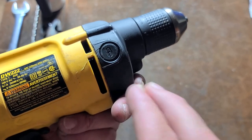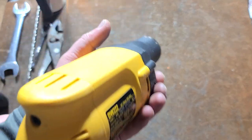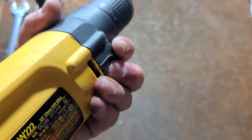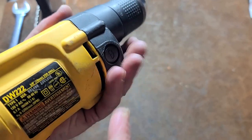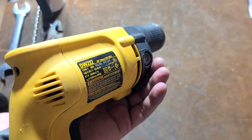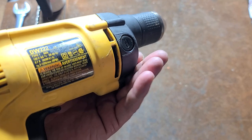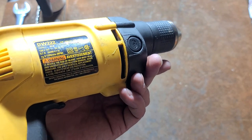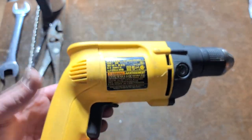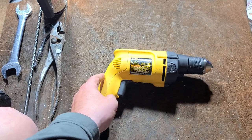This is a lock — just like on angle grinders it locks into the gear, but in this case it's actually a tooth that jams into the motor arbor itself. So if you're running this drill and you kind of forget, or you're doing heavy-duty work and you press that in, it's going to end up grinding the spindle on the motor — the most expensive part in the gearbox you could damage. DeWalt just stopped doing that because they had too many warranty claims over it. I have some DW-235Gs and you'll recognize this body shape.